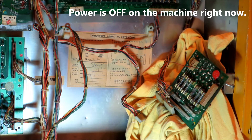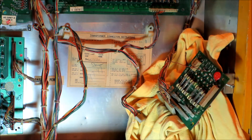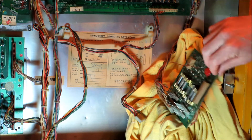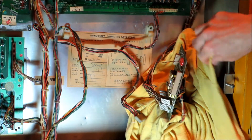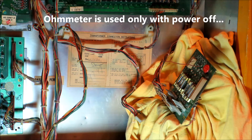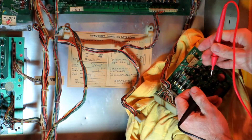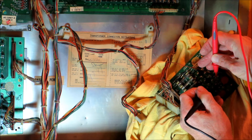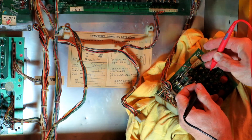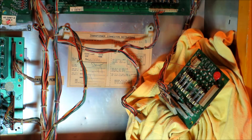Some initial diagnosis: I put a shirt behind the board so it wouldn't dance around and hit the metal, and I cleaned the connections — they were dirty. That got me back the general illumination and playfield lighting. I tested the bridge rectifiers with an ohm meter: connect the black lead to the AC side and the red lead to the positive voltage side — you should get open resistance. But on BR3 it's reading a dead short, while the other two show open. So I've got a bad bridge rectifier, and the question is whether something downstream is blowing it.